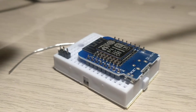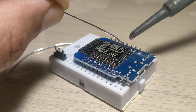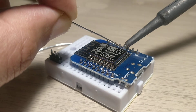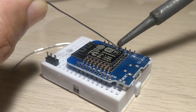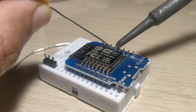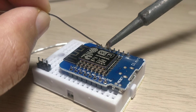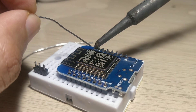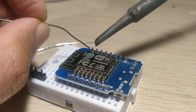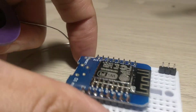There you go. Heat the edges and solder it up. Heat the pin, make sure it flows well. Just pour the solder around a little bit so that it grabs on properly. Take note — most of it is looking great. Let me move to the other side.